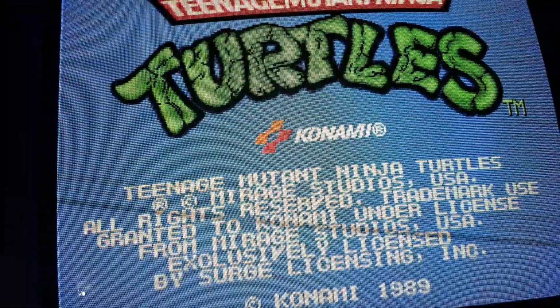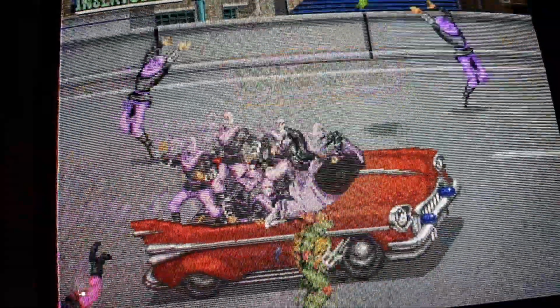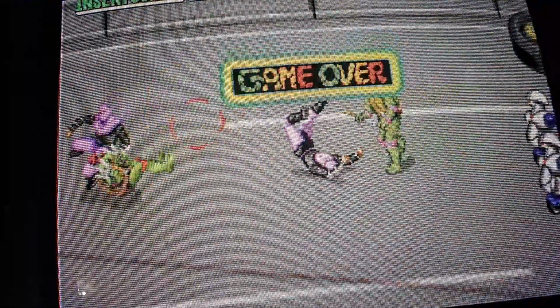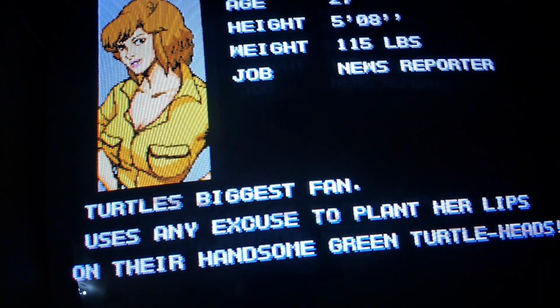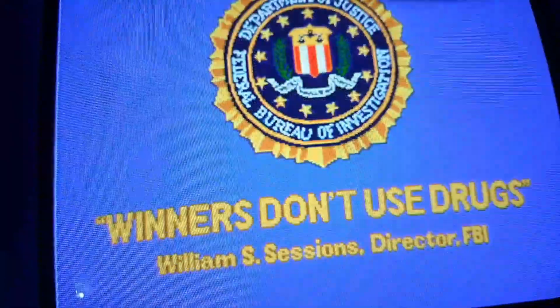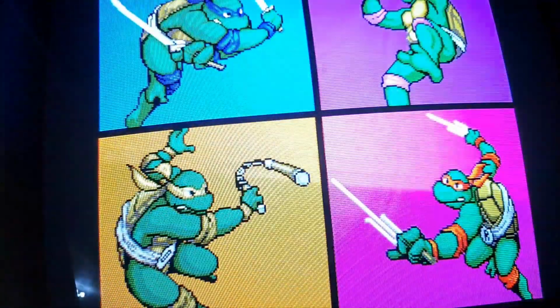I mean, this, the only difference is the flyback. And the remote board has not been touched. But anyways, I am going to let this run a while, guys. If I notice anything, I'll come on and document it. If not, then it made me look like a fool. I don't know what to say. What would the difference be between this chassis board and the last chassis board that makes this flyback do what it was doing versus this one not doing it? But the other new one on the other chassis is fine just like this. What the hell? It makes no sense.